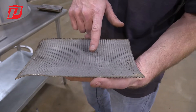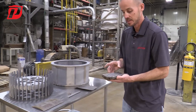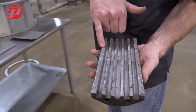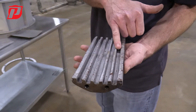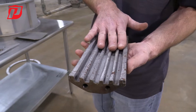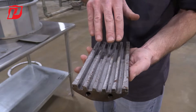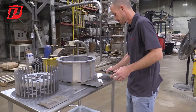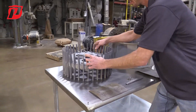Another aspect that could happen inside with the screen frame is with the grinding jaws. If you start to see ding marks or on the straight parts of the jaw you start to see rounding on the edges, that's showing you that part is starting to wear as well. It's good practice to start taking those out and replacing them, because if the jaws start to wear then you might lose efficiency on your grind cut.